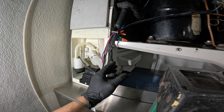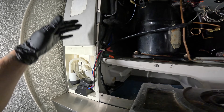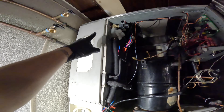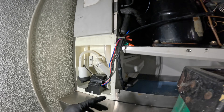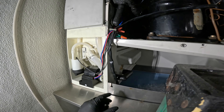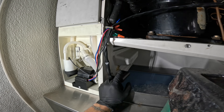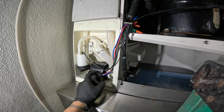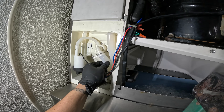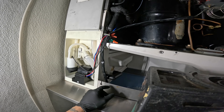What happened is that when it first starts it goes into a fill cycle — it drops water through this solenoid valve, allows water to pass through for 60 seconds, this tank fills up, and that's the water you need to produce ice. So after about 30 minutes most of that water in the tank became ice, so the pump didn't have water to pump — that's why we started getting air in the lines. The tank wasn't full of water, and at that point it should have dropped ice.